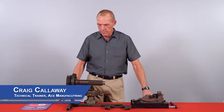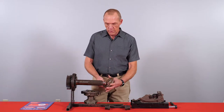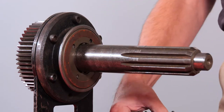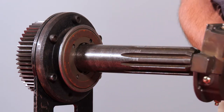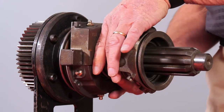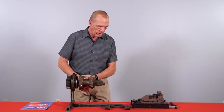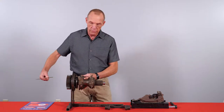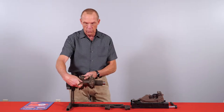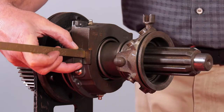In this video we are going to discuss clutch adjustments. The brake is already on the input shaft. We slide the transmission into the clutch and we're looking for two measurements. Measurement number one will be the eighth of an inch between the throwout bearing and fork. What this eighth of an inch does is give us our free play inside the cab.